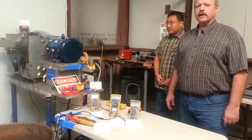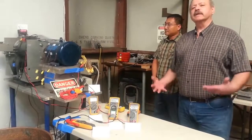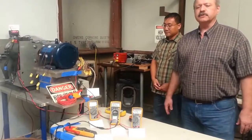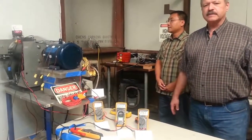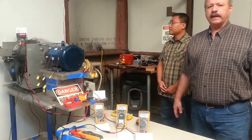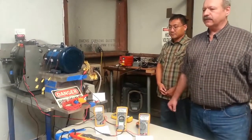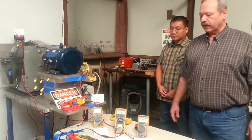Okay, now we are here with the unpotted motor, and now we have cranked up the output power to dial up the temperature that it's operating at. We've arrived at a temperature that's basically the Class F rating of the machine, as close as we're willing to safely get to it. So we want to describe what we have for this operating point.